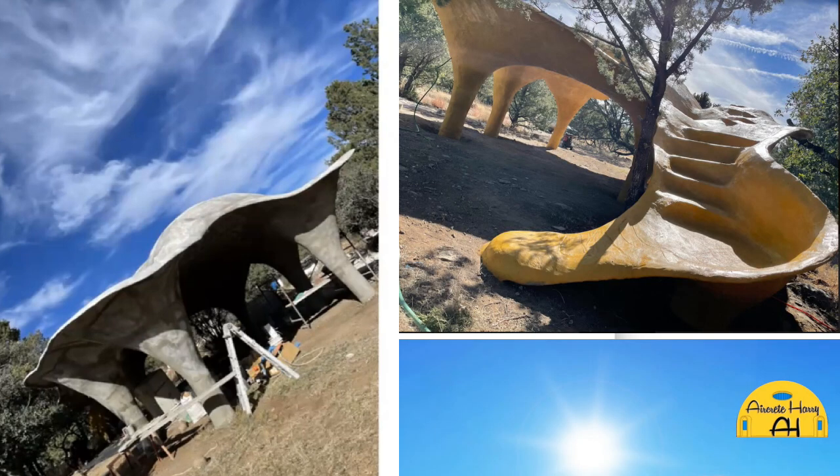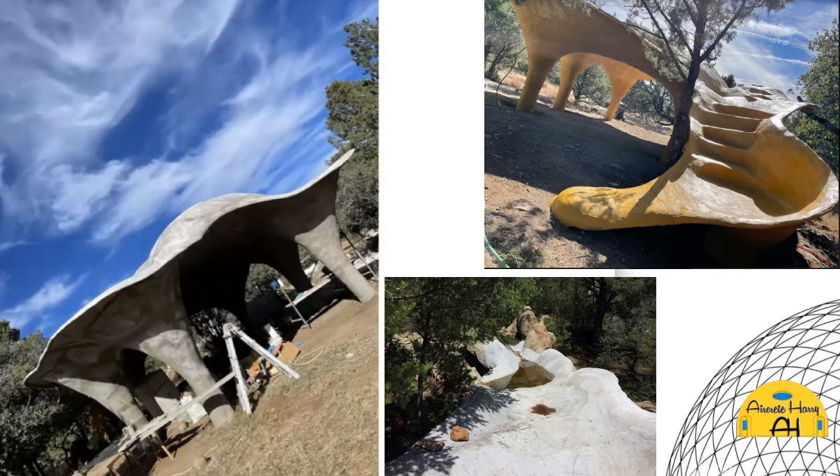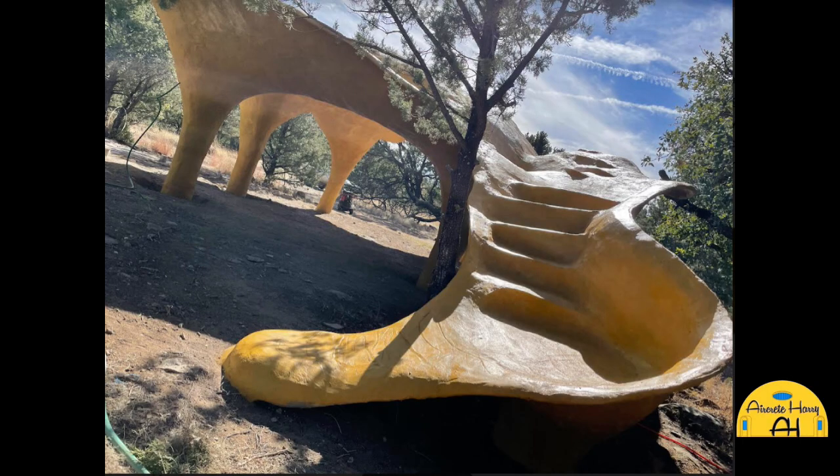I'm going to have to show you one of these blocks. This one was doing a 16-foot span, so we used one of the 3 block. This is what we build the trusses out of. We have a little folding machine, and we use the hog ring gun to attach them together. I call this 18 inches, but with the 3/4 inch surface shell on each side, it's a little more than 18 inches in reality. It's about 20 inches, though I sometimes refer to it as 18 just because I'm referencing these 6-inch spaces.